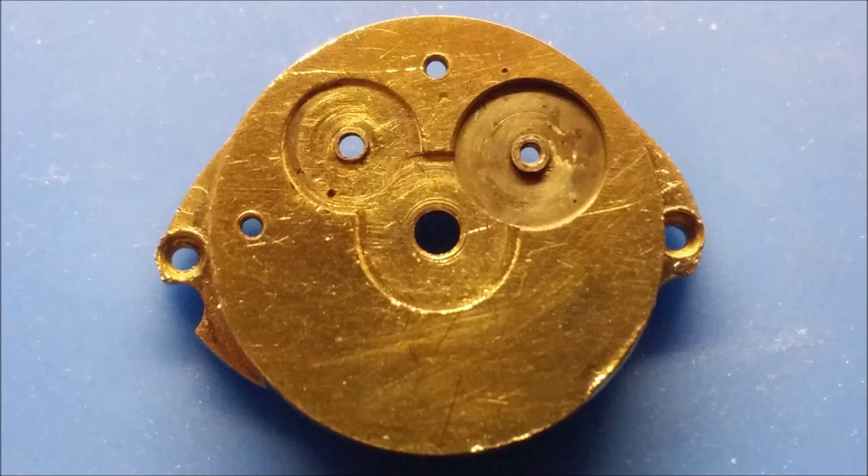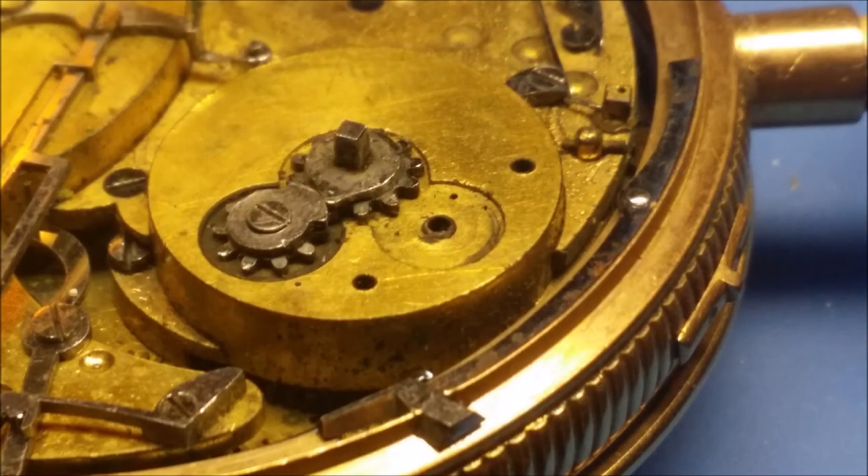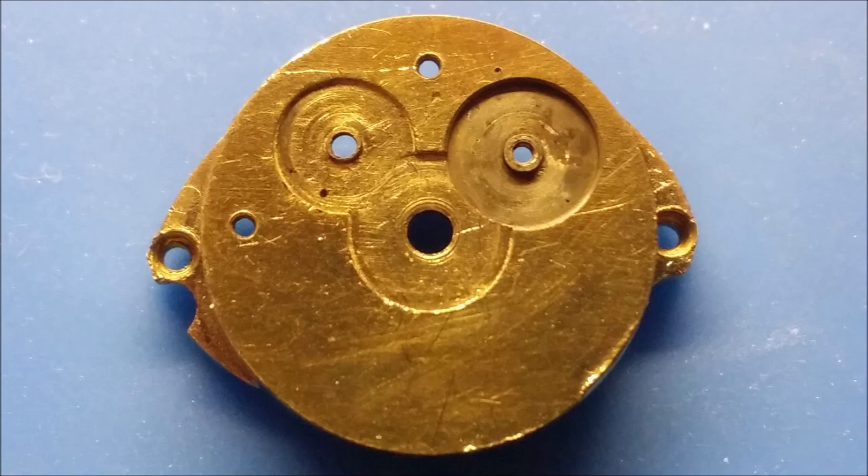A previous repairer, instead of making that hole such that a screw would hold in it, actually cut a new recess into the barrel cover. You'll note in the pictures that one recess still has its original gold plating in it and the other does not — that's the one I suspect is the newly machined recess, and you'll notice that the screw hole is smaller there. Contrary to my initial thoughts, I did not make any replacement parts, but we're just going to keep the newly machined recess for the stop works and leave the old one as is.